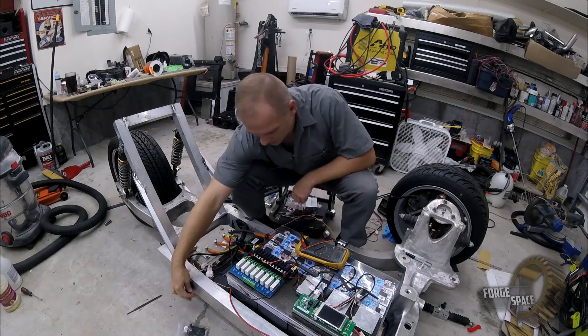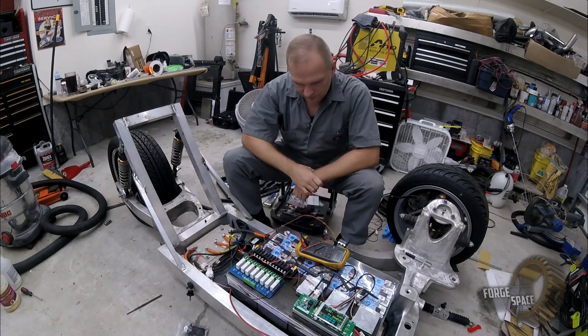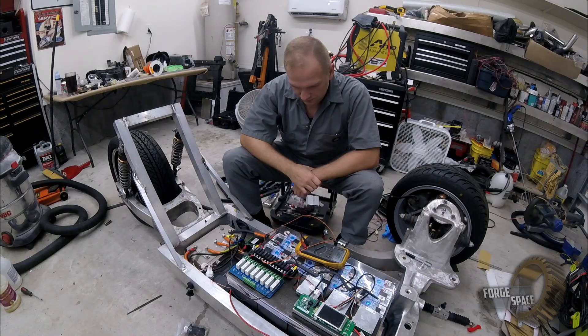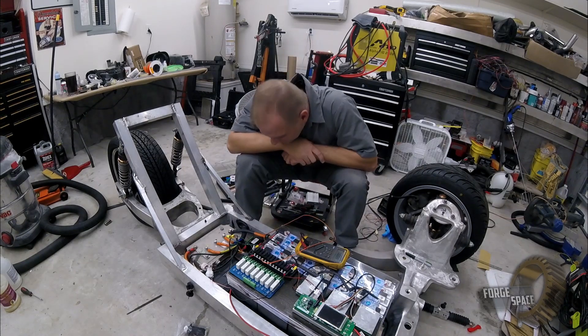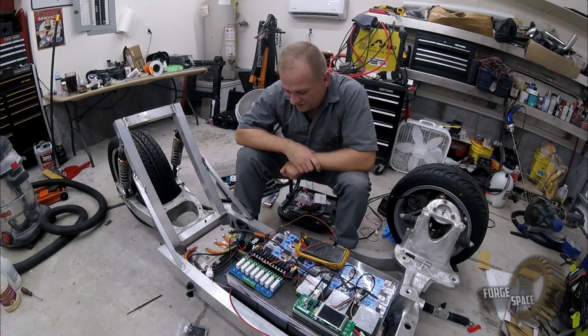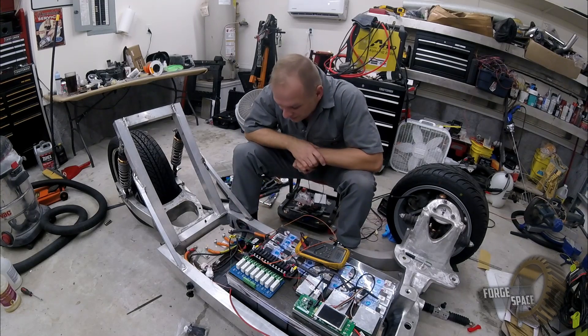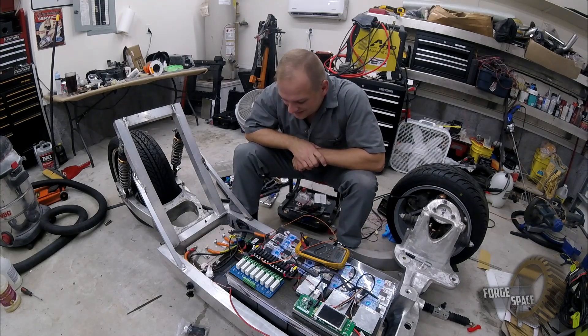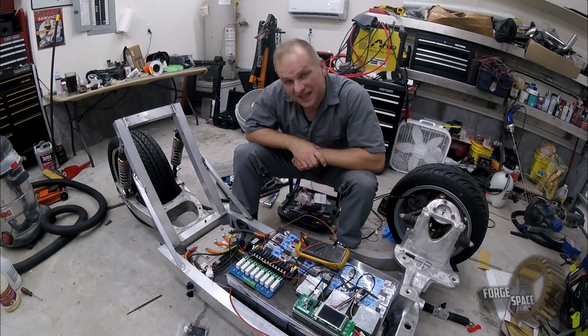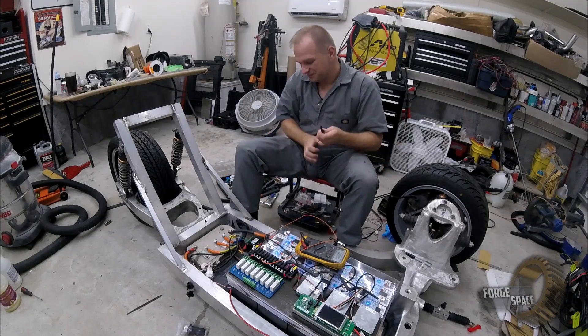No contact. Now why would that be? I think I figured out the problem — coil voltage: 96 volts DC. And here I am trying to apply 12 volts. So I think I've got to order a new contactor. That's fun.